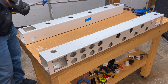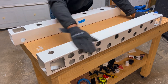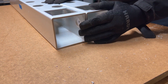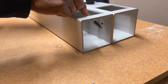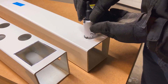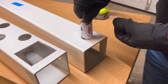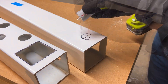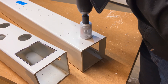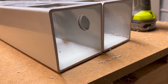To make this critical step easier, once the first hole was cut out, I set the rail against the uncut rail, made sure my work table surface was flat, and then used a marker to mark where the hole needed to be cut on the second rail. I then disconnected my hole saw from my power drill to pre-align it over the marked circle and score the plastic surface with the drill bit to create a pilot hole. After both holes were cut out, the holes lined up perfectly.